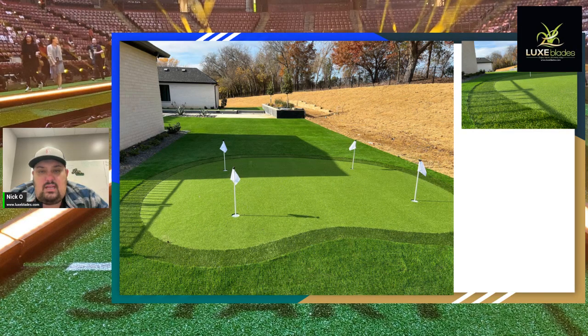So then we'll take some paver sand or something like that and go over the top of the base material. Make sure it's nice and flat because sometimes that plate compactor can leave some ridges. And so we're gonna take a roller and roll it all nice and flat. So that way there's no ridges, smooth as a baby's bottom.